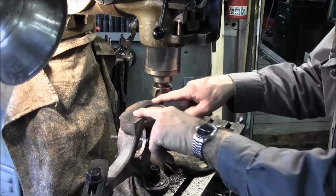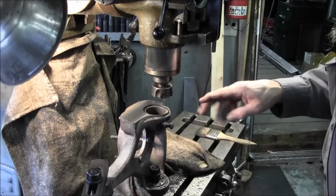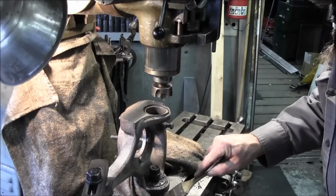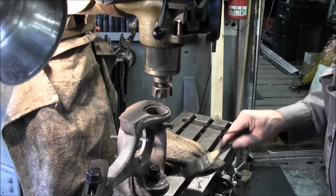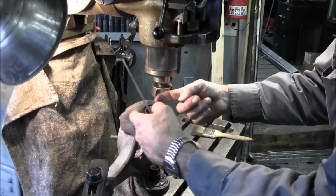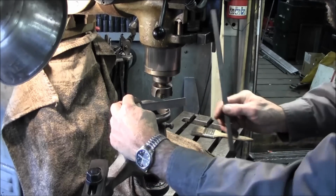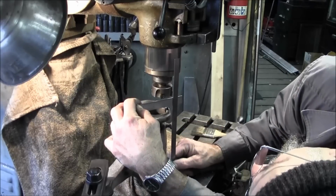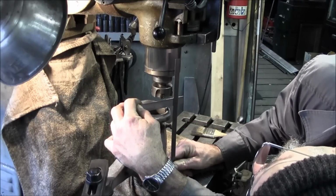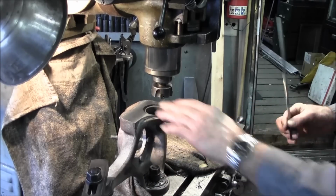Okay, the first thing you're going to be concerned about is mismatch between your cuts. That feels minimal. Of course, we are hogging off quite a bit in our cut there. It was real shallow over here. You can see that it didn't cling to the edge, but as it got higher over here, it was heavier. All right, now we're going to get a true measurement straight down here. And we are 7 inches, 800. All right, so we're about 100 thousandths high right now.